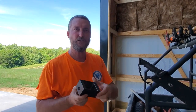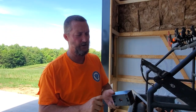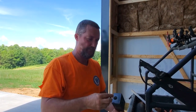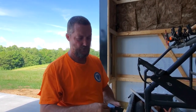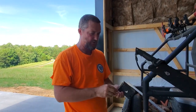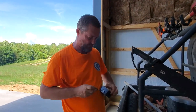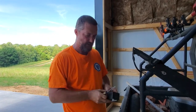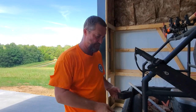Okay, these are going to be the wall boxes for outside. They're bronze, they're not black, close enough, you can't tell the difference. Metal, and then we'll put a weathertight cover on it. They come with plugs for the screw ends that you do not use. I'm not going to use the two on the sides, so I'll put the blanks on the two sides. Screw those in. Just a little tight, nothing extravagant.